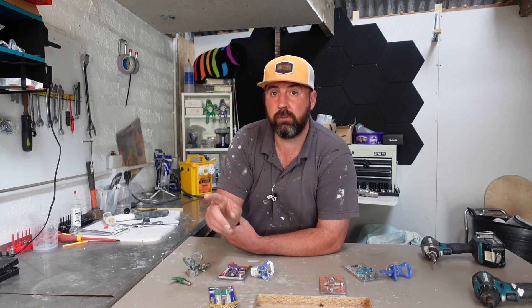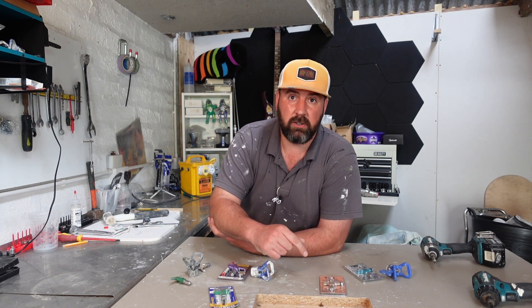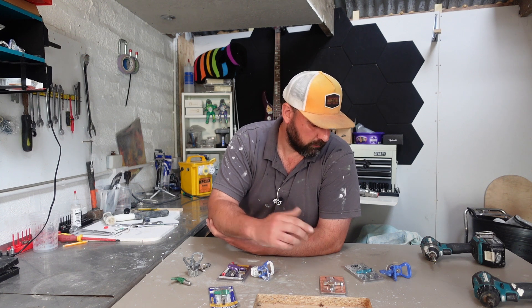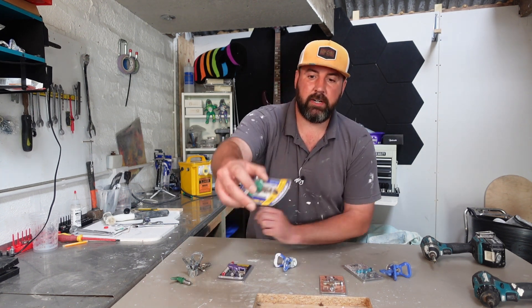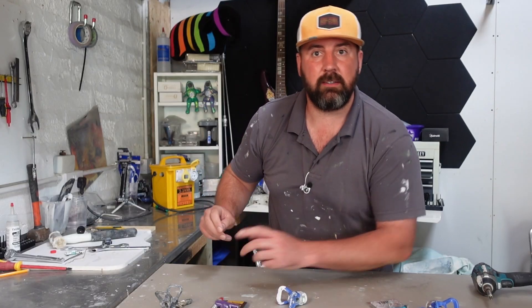What I've noticed is that if you change over to a Tritec, it's a totally different fan pattern. A lot of the tips I use now are the Tritec ones - I just found they gave a more solid fan. We were having so much trouble with the diamond shape forming with the FFLP or LP tips, so I swayed away from them for a bit. I do still use them but I'm mainly using the Tritec Ultras or just the standard green Tritec ones.